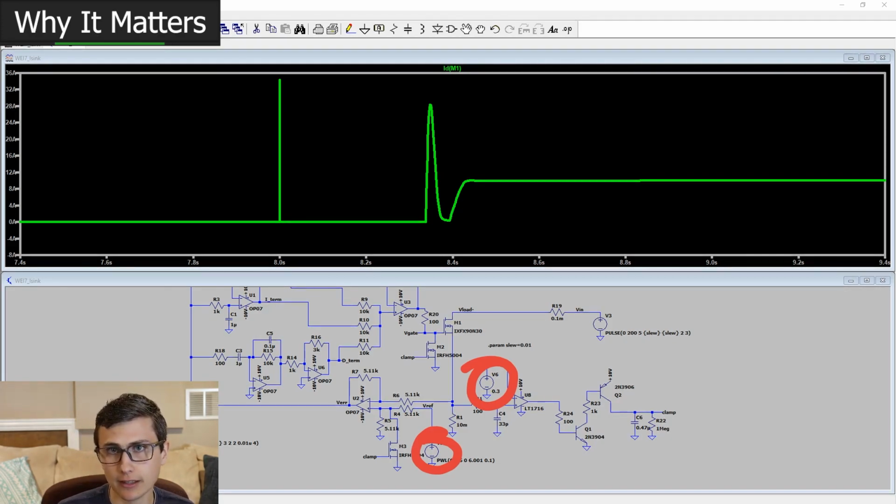And the intention here is to have a controller that is running independent of the micro. So we've got a hardware control loop that is always regulating with some kind of interface to the digital world, so that we can either have programmable step currents, or you could give it like a file, like a PWL file, like you can in LTspice, where you basically end up with a programmable load where the microcontroller could read from an SD card or could receive commands over USB or serial or whatever, where you basically give it points or times or do real-time data transmission and have it live update.